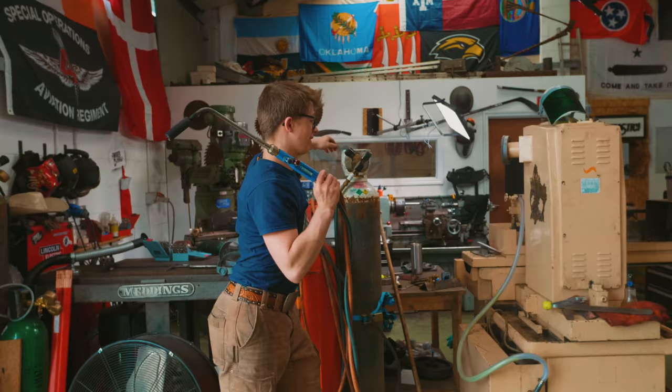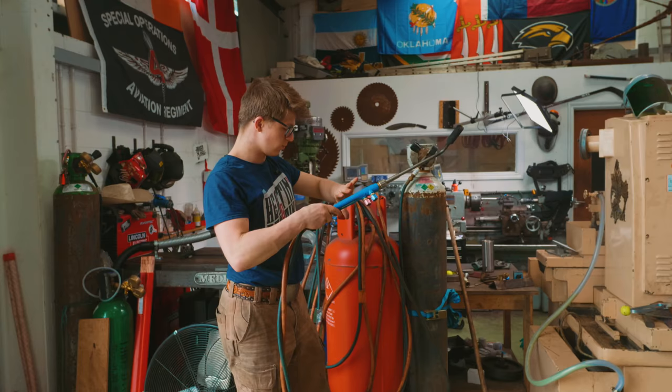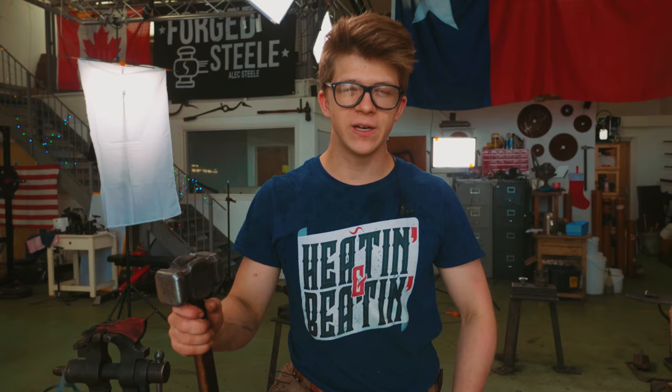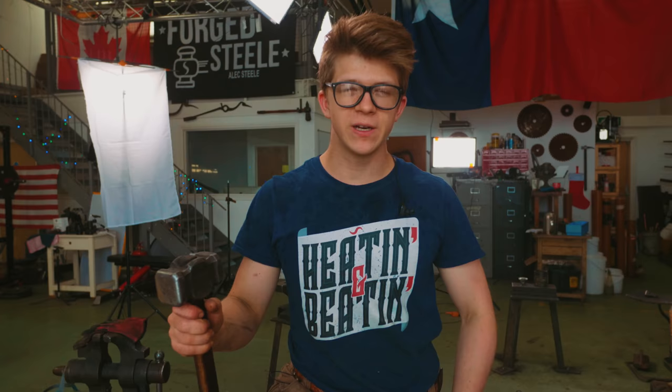It glazes with the file — that's what we want. Now I've made a lot of hammers and I've used a lot of the hammers that I make. With this particular steel, that's the heat treat. Which is one of the reasons that I love using it because I got fabulous performance out of the material with a really efficient and quick heat treat like that. When Sam and I were quenching a boatload of these things we moved through it fast. It doesn't take a lot of time to heat up the face — you heat up one face at a time.